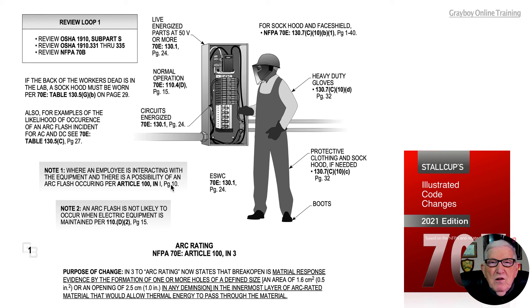To interact means you are either testing in some manner for voltage, current, and so forth, or you are actually making some kind of repair — to be considered interacting as defined under "working on" in Article 100 of NFPA 70E.